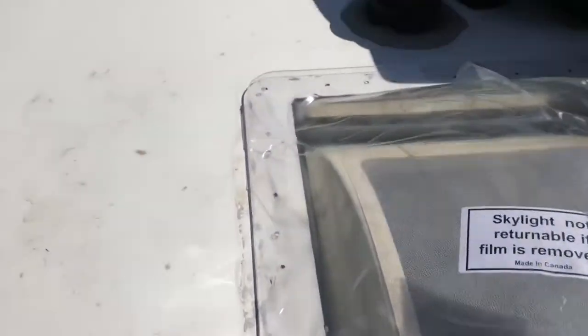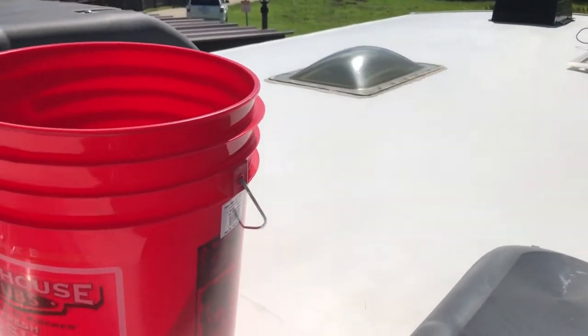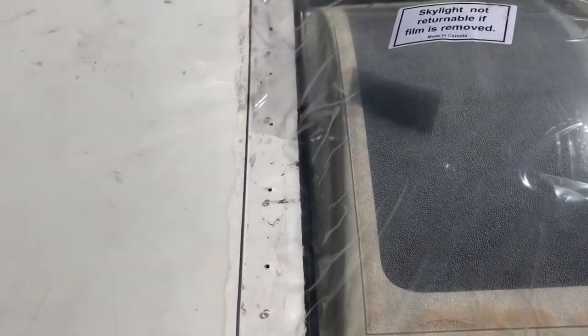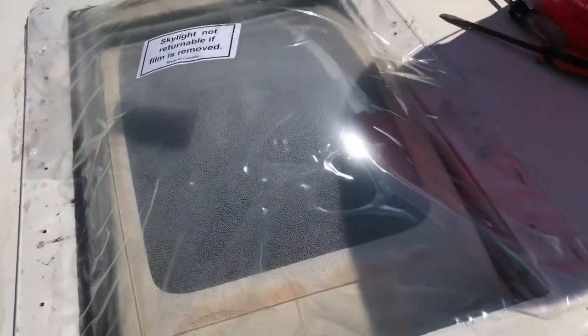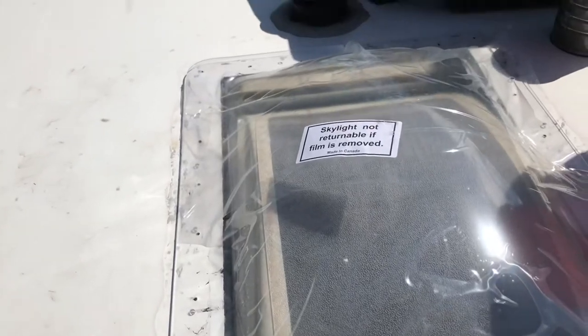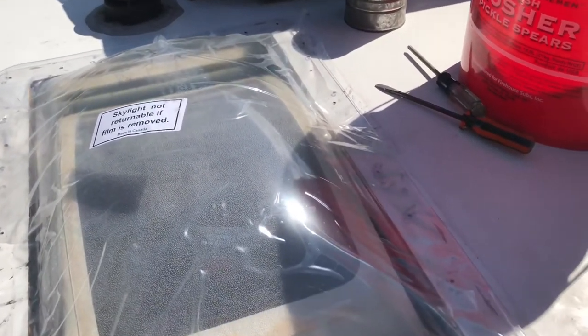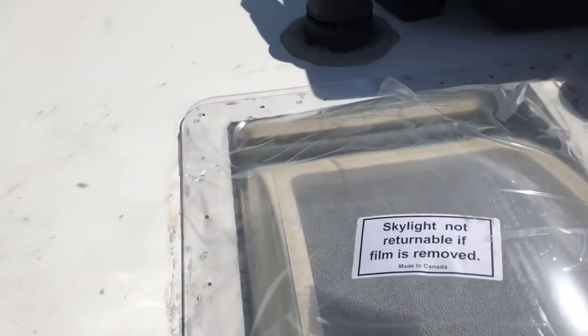You can see that the holes don't line up exactly, but that's okay because we're going to re-drill new holes with the self-tapping screws. Looks like there are maybe even fewer holes — that's fine. One thing I learned, which is why I got one replaced twice: you don't want to tighten the screws too tightly. Tighten them just enough to pull it snug, but you don't want to flex the skylight because if you do it will crack. Come back with the self-tapping screws but don't tighten them too tight — use the drill to start them and then just hand tighten.